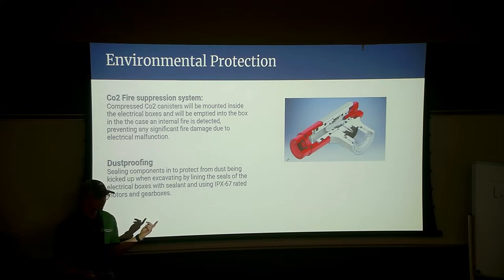We have sensors that can sense the robot is approaching its stall current and cut power to it, and then the computer knows, hey, I can't move this way, let's back up and find a different way to move. Ideally, we wouldn't have any issues with overcurrent in the first place, but this would be a last-ditch resort if something were to happen with the battery or whatever.